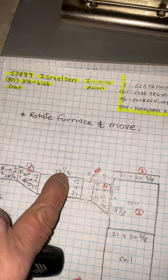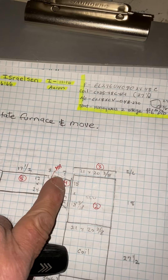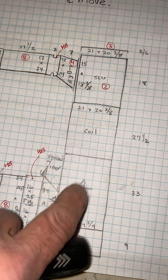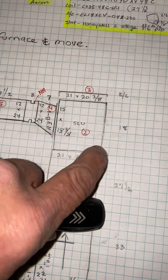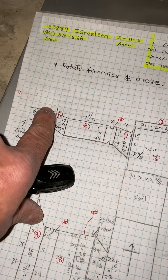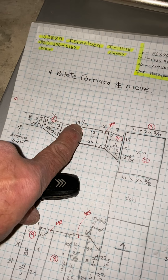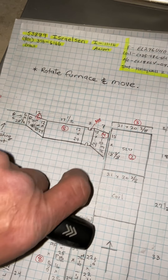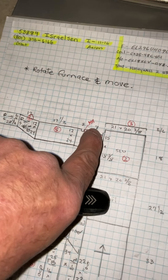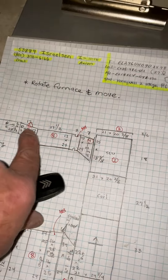You're going to add this piece — this canvas starting collar. Duct to sit on the base, furnace will sit on the base, then the coil. So this will go down half an inch, and then this sets up three inches. Just put it where needed. Came down half an inch.